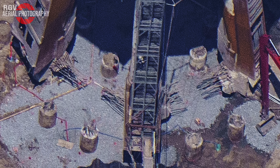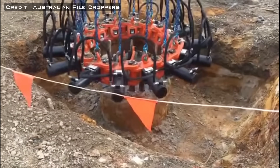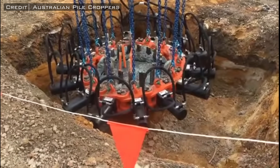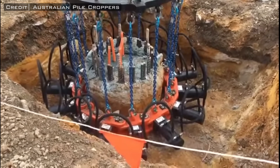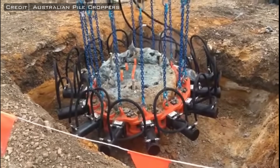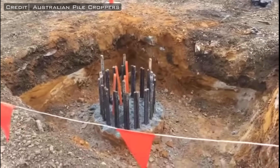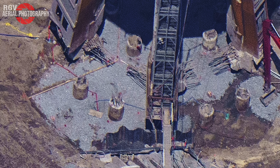As mentioned earlier, all of the casings for the RBP pilings had been cut away, leaving the tops of the columns exposed. Each of these will have to be cropped down to the height of the eventual blinding layer. Using a cropping machine, the concrete can be pulled free while leaving the rebar intact. After this, the rebar is cut down below the height of the future pile cap. Just like the demolished tension bands, this will be used to tie into the massive pile cap.